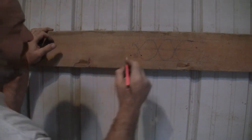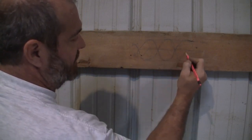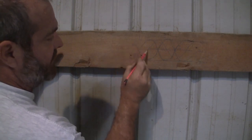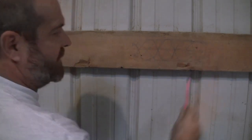Now, if you had a third phase, that third phase would even out a little bit differently because it would split down the middle of these guys and hit like this. Okay, so you get those. Now, there is a fourth phase for those people that are wondering, and it looks something like this. So there's a four phase out there that makes it even smoother. All right, so this keeps everything going down. It gives you a few things. It gives you more torque. It gives you a smoother run, and your amperage is not going like this all the time. All right, it also allows you to let your motor run a lot longer.